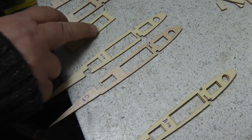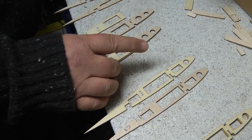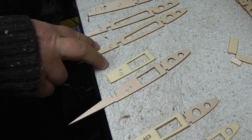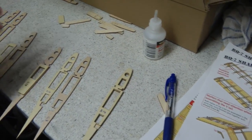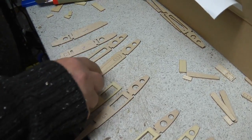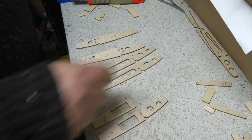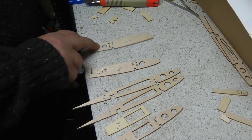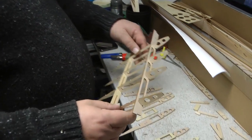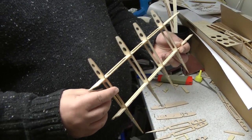We've got an A13 which goes on to C13 - there's a strengthener again. Then we've got C2 - C2 is the main set of ribs. On the actual laser cutting, these C2s are marked up as C13s, as you can see. When you break that bit out they actually say C13 - they're not C13, they're C2, so you should have eight of those. Then you've got C10 at the other end. We've quickly mocked up the first part just to try it, and that's generally what it looks like before it's got all its ribs and strengtheners in - and as you can see it slots together.